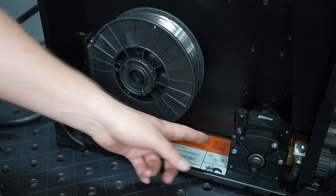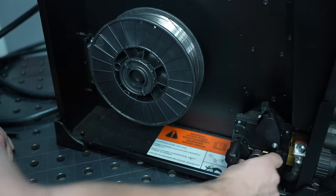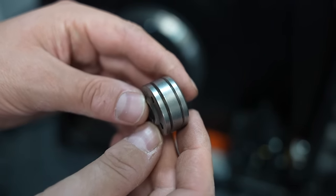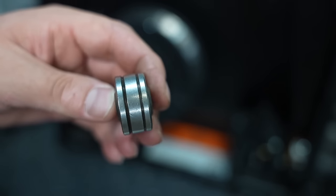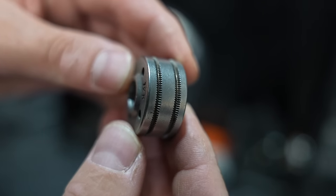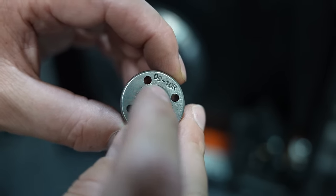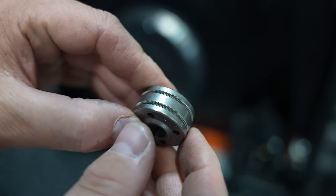Before putting the wire into the feeder, let me release the idler tension and talk about drive rolls, because there are specific drive rolls for flux core welding. This drive roll I just removed has two smooth deep V-grooves — those work well to grab solid hard wire. Flux core wire is tubular though, just metal on the outside filled with flux powder, so instead we use a knurled roller like this that can really grip those edges. There are generally two different sizes, and the size reading is listed on the outside so you can read it when it's installed.